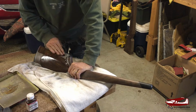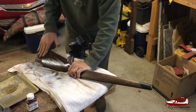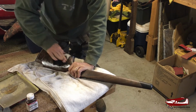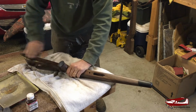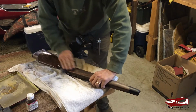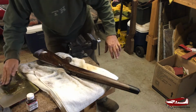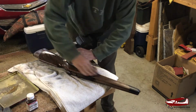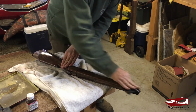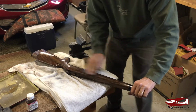And it's messy, and you just slather it on and you can't screw up. I mean, it looks like it's everywhere, and you just keep sanding it. If it gets too thick, thin it. And you can hear with sandpaper, if it's still rough. As it goes quiet, it becomes smooth. So you sand until it goes quiet. And you'll see it not trying to go in the wood in places, you just have to sand harder.